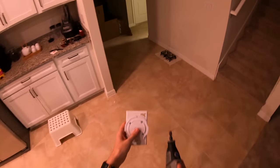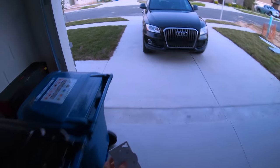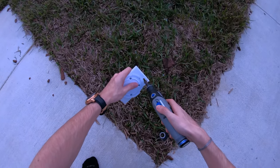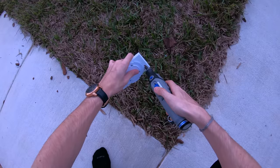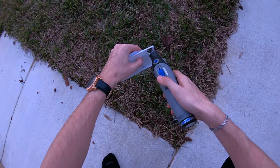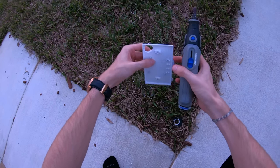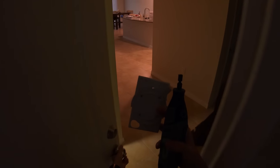And very quickly, Dremel. So yeah, the drill just basically cut some holes out for us to get us started with the Dremel. Make it a lot easier here. And essentially, all you want to do is cut a hole that's large enough to allow an Ethernet port to pass through it. Not really necessary to clean it up very much because it's all going to be covered by the access point itself. But still, a hole about that size should be good enough.